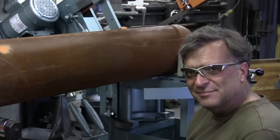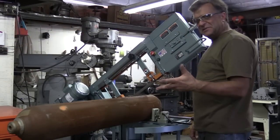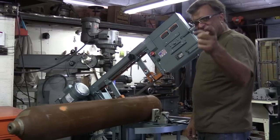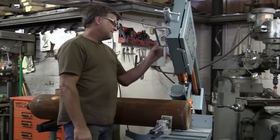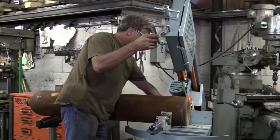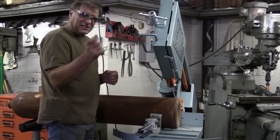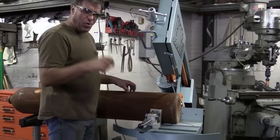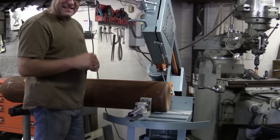So Lemmy fired this puppy up and put it to work. This is probably going to take somewhere in the five to ten minute range, so run and get your cold drink and come on back to see it finish up. I'm still guessing at just how fast to let it feed. I know this is about a quarter-inch wall, so I'm going to want it to go real slow just so we don't overheat the blade.